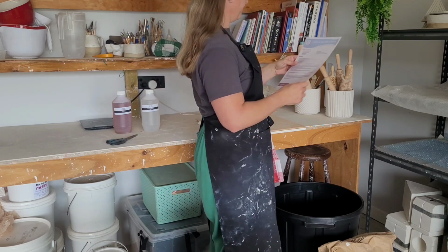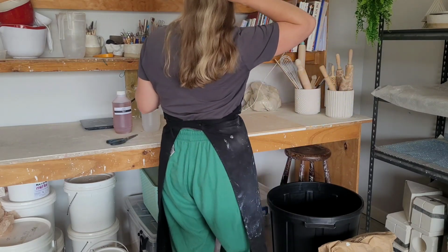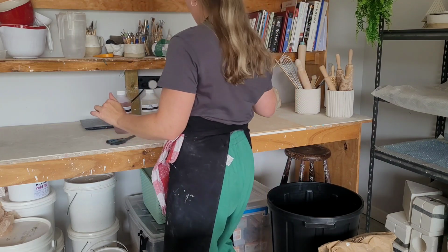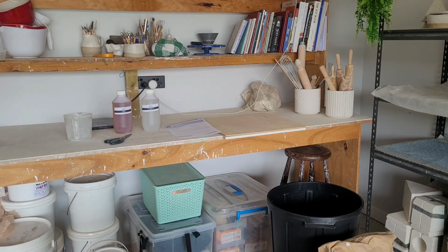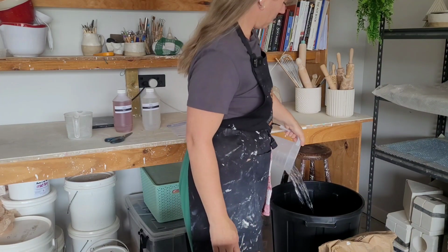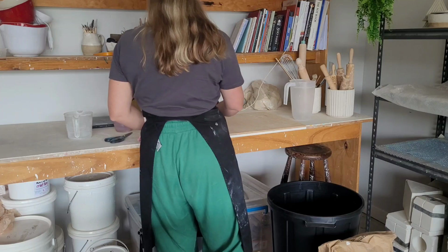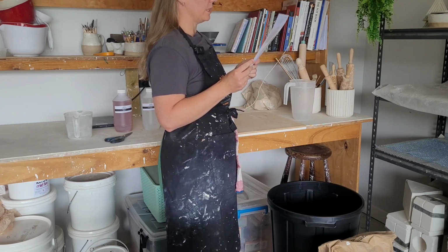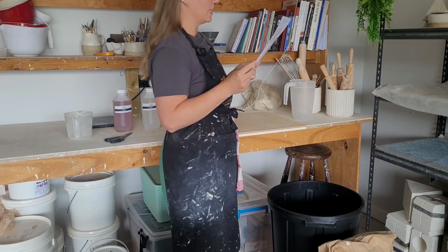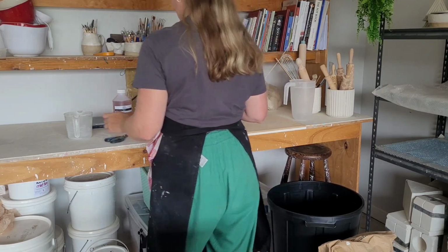Step 1, 10 kilos of clean water into the mixing bucket. And so it starts. Next step. Turn on mixer and add 40 grams of sodium silicate to the water. Turn off mixer when done. 40 grams of sodium silicate into the water and mix.